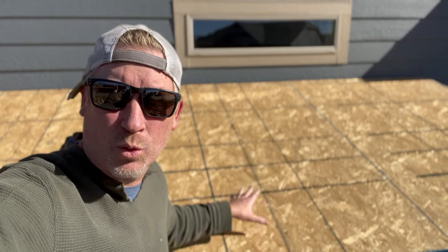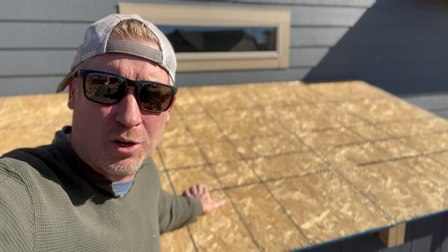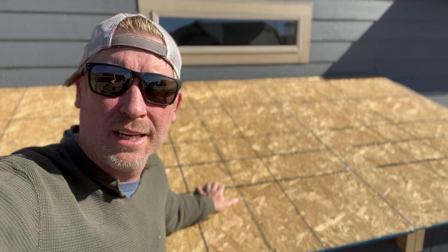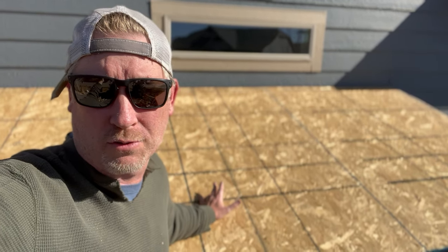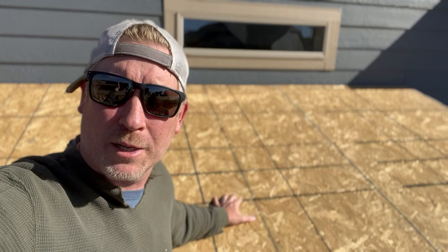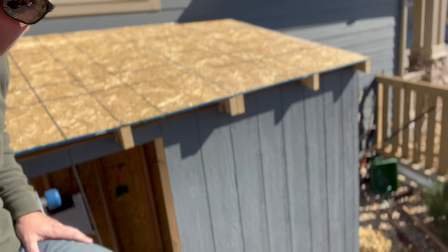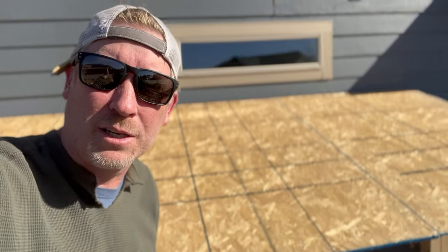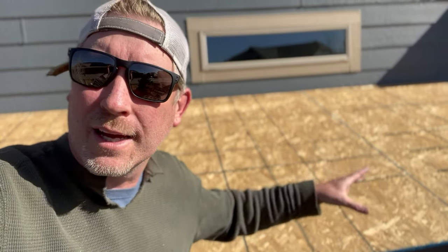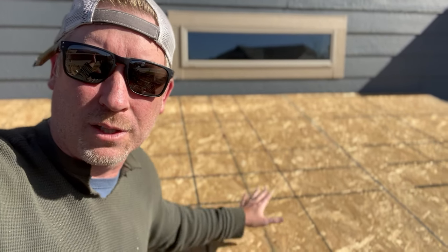As you can see, the roof is on. I ended up cutting three panels that go across here — each four foot wide, and each panel has 15 screws in it. Five rows of three. Now I'm getting it prepped. I did some of the painting earlier today too, so the shed itself is painted. Getting the trim ready to go, so then I can put the shingle edging on around the edges, and then we'll get the felt paper down and get the shingles on. Making progress.